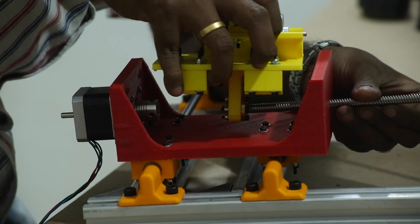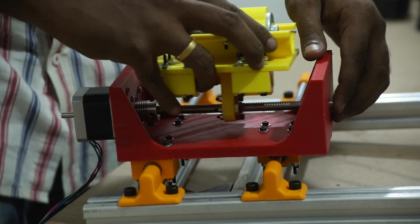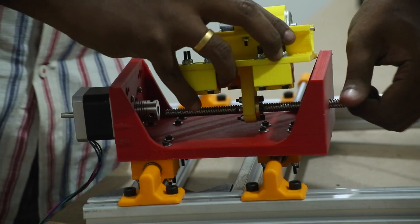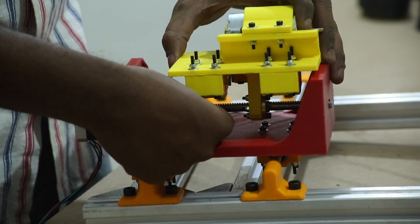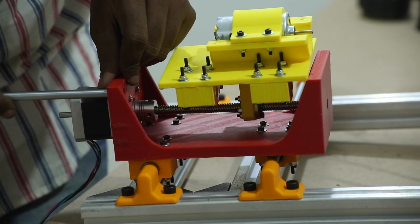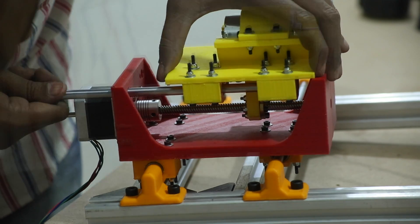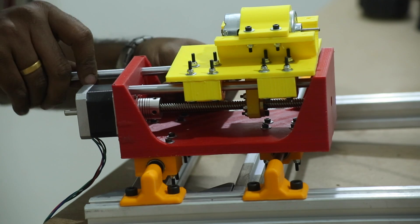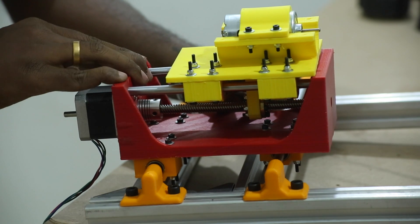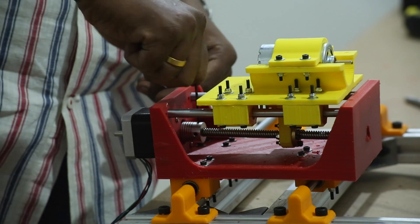Usually at the bottom a bearing is added to keep the rod in place, but here I missed it and there is just an 8mm hole. In the design which I will be releasing at the end of this series, I will give provision to add a bearing. Then the 8mm smooth rods can go in place. Using Fusion I was able to align the holes to slide in, and I'm happy that everything aligns properly because I designed them with exact measurements. Sure, ABS shrinks a bit after printing, but I had taken that into account and gave some tolerance while designing. So it's all good.